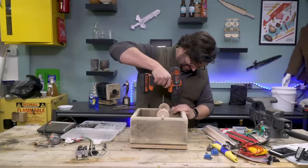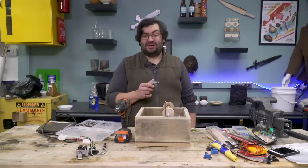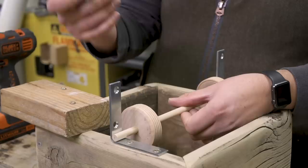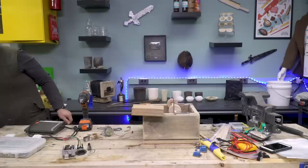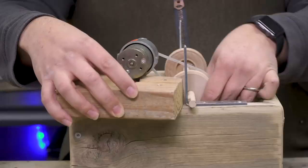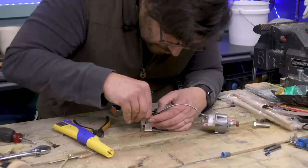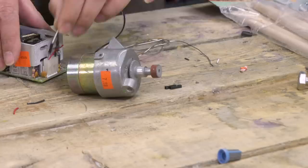Got to set that torque a little bit lower so I don't break my wrist. I have the spindle in place with two keepers here and here, which are going to act as our bushings as well. I have put this block in place to try to mount the motor on, and I'm going to have to do a little bit more adjustment and probably also saw the block down to size. This is a power supply, going from AC 120 volts down to 12 volts DC. This also allows us to introduce relays in there to both control the direction of the motor and turn it on and off. This here is what we call the Stompy Stompy, and on the speed side we have an Arduino that we can use with a potentiometer to control the speed.